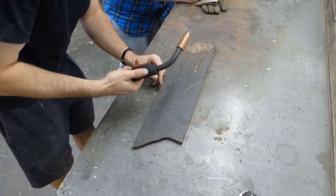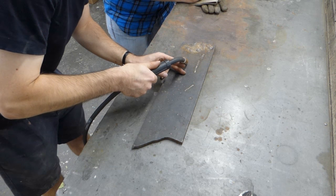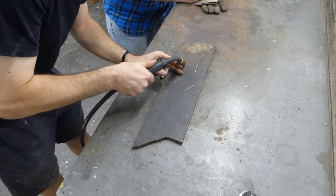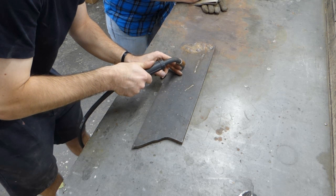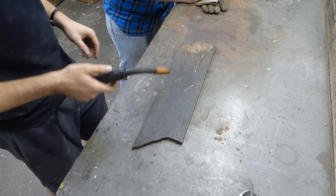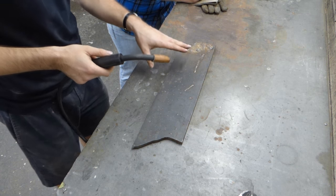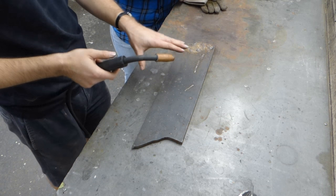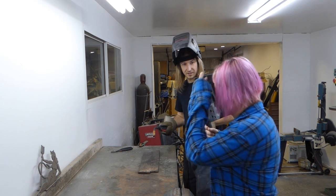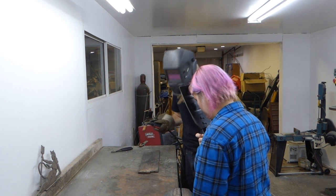So what you want to do is position your tip, depress your trigger, and then move slowly in an alternating back and forth pattern. It has to be back and forth? I can't draw anything else? Well, there are many different patterns you can use. But for this initial lesson and the most basic form of MIG welding, it's a back and forth pattern. I can't see a thing. That's right, you won't be able to see anything until the welding arc is created.